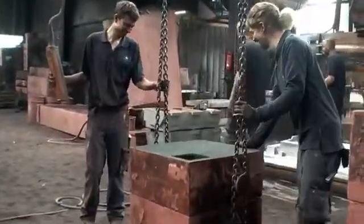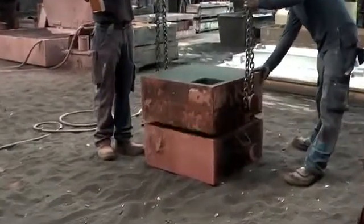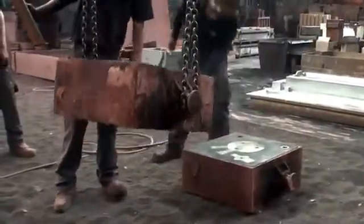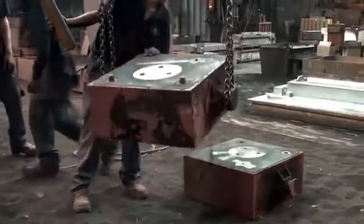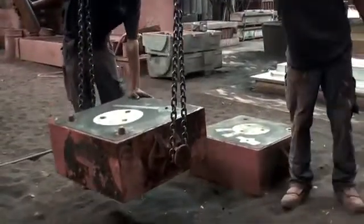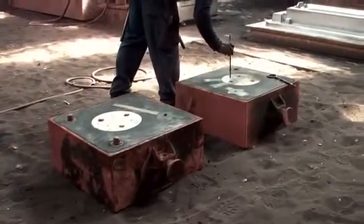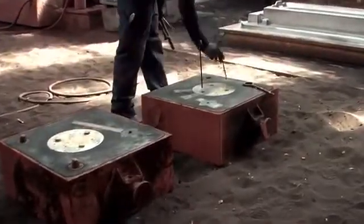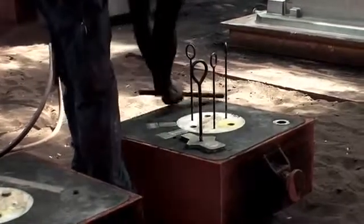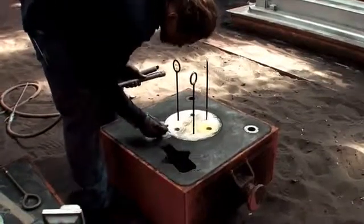Now the halves of the mold are parted to remove the pattern. The two protruding knobs that are visible on the top part are there to interlock the two parts in the right position. So that's the moment when my threaded inserts in the model become important. 3 hooks are screwed into them, and with carefully knocking upwards, the pattern will eventually come loose. Of course, the pattern has to have no undercuts, and the vertical surfaces need to be slightly tapered.